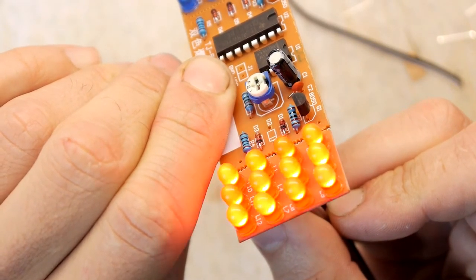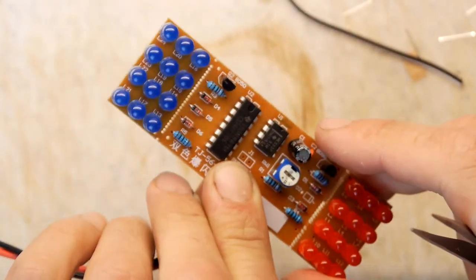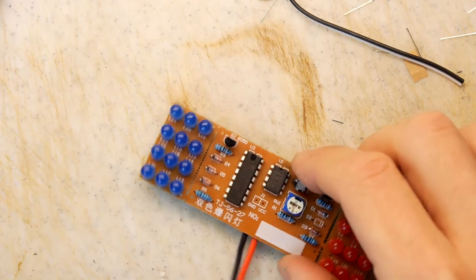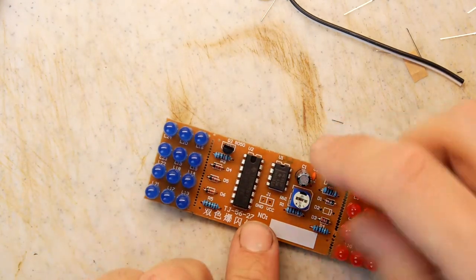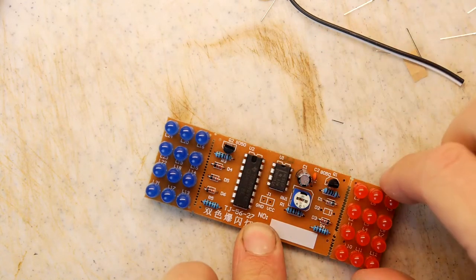Yeah, you see that? Fills out that gap. I kind of suspect you don't need a diode in there. I think you could just bridge it across. Now, my more concern though is to do with this other side not firing at all. So just having a quick look to see what could be wrong with that.